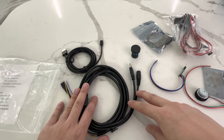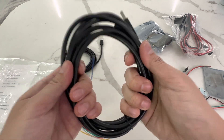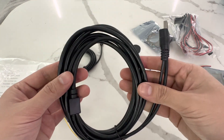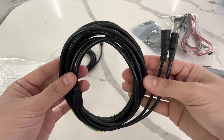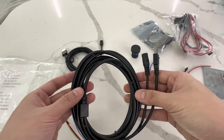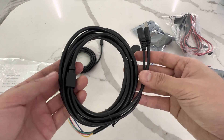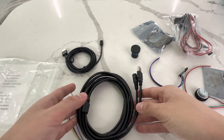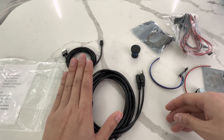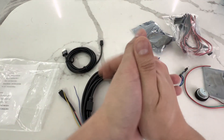This is obviously Ultimarc inspired — big respect to Andy at Ultimarc — but I wanted one that's heavier duty while still being lighter. This cable is 10 feet. We don't exceed 10 feet because the maximum distance for micro USB is already 15 feet, and that's already pushing it. If you go more than that, you may end up getting signal drops and data packet drops that could cause issues with your gun. We want pure perfect signal, which is why we use 22-gauge copper wire. Enjoy guys, thanks for watching, I'll see you on the next one.